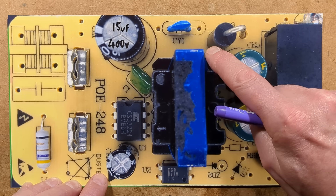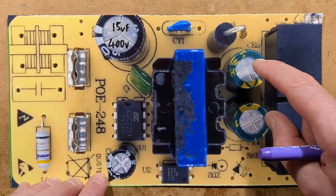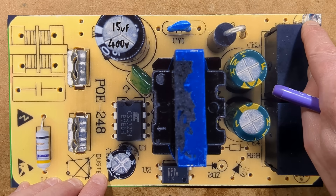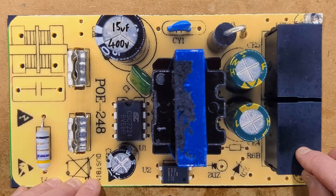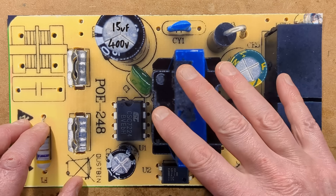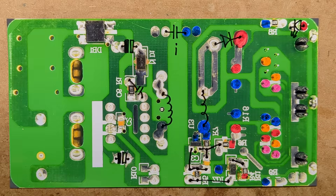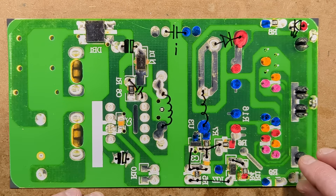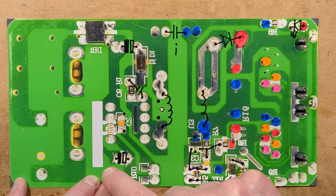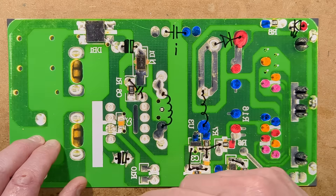There's a fast recovery diode — not Schottky but fast recovery — on the secondary. The schematic shows two capacitors with an inductor between them, but in this case they've just got two capacitors, then the connectors, and a cheeky little blue LED. Also part of the snubber network. Let's take a look at the back of the circuit board which has a lot more components. I've flipped the image so everything tallies up. You can see where they've effectively bridged out the common mode suppression choke and just omitted the pad for the class X2 capacitor even though the hole's there for it.